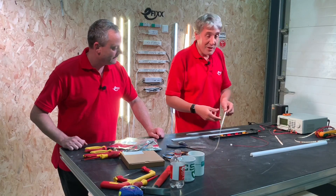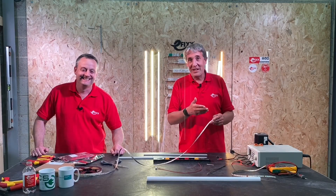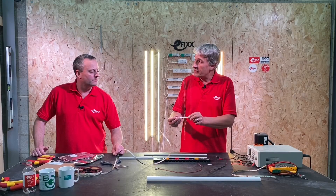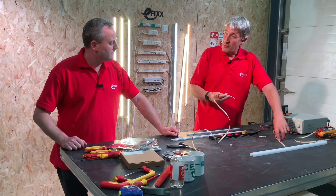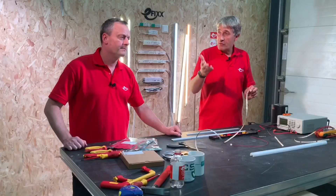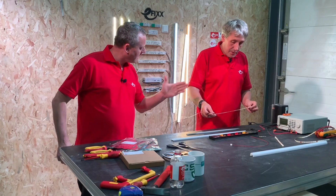The solution is from this Osram range — you can get a short pitch version, which means there are more LEDs in that space. When you buy LED tape you'll see it specified as a number of LEDs per meter. This 24V short pitch has more LEDs per meter — six LEDs between each cut point — whereas the standard one had six LEDs spaced further apart. I would always say 24V tape is more efficient than 12V LED tape, and we'll look at that in another video.